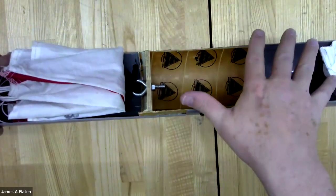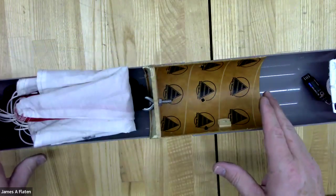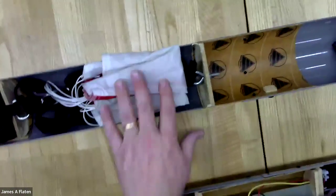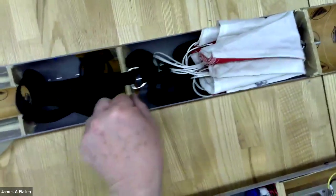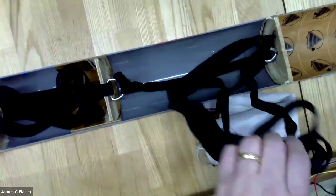including the nose cone and the upper section, and the coupler tube going in one direction, and the entire lower half going in the other direction, and the parachute coming out in between. In this case, I have a single parachute. It's quite exposed. And the reason it's exposed is because it's protected by a sliding piston. So this is a little unusual. Let me set the parachute outside of the rocket.